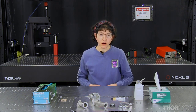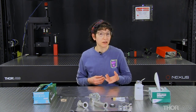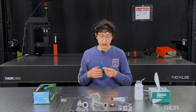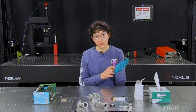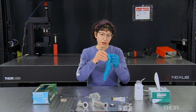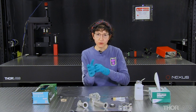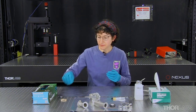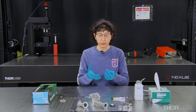These metal components have hard, sharp, pinchy edges, and because of that there is the real danger of ripping a glove and getting a fingerprint or blood on something when you're working with these components. That's one reason I always double glove. Another reason is that it's not unusual to have to touch something that will contaminate my gloves, and then I'll have to change them before touching something sensitive. When I wear gloves my hands perspire, and I find it very difficult to pull a glove onto a hand that's not completely dry, so it's much easier to pull a glove on over another glove.